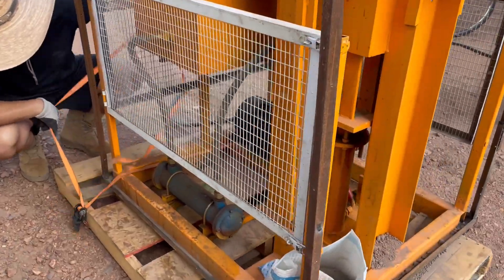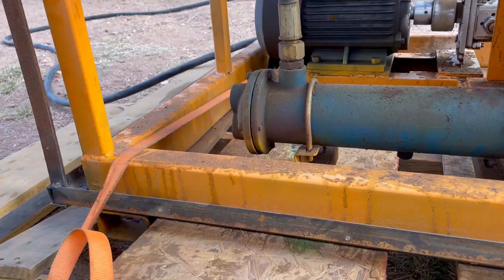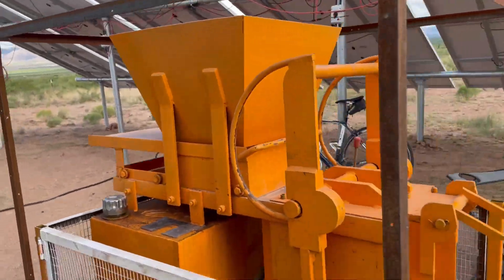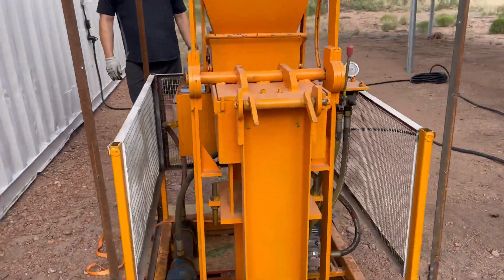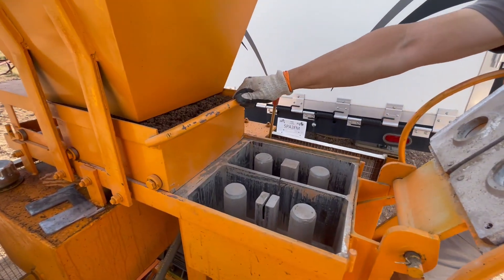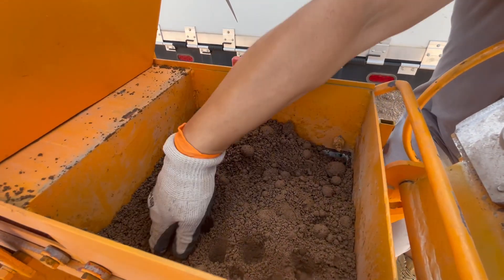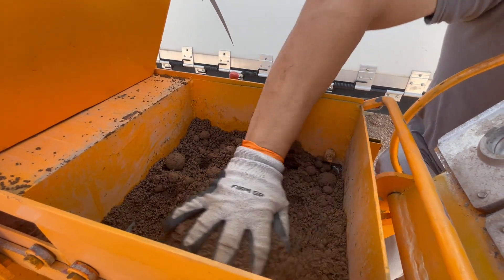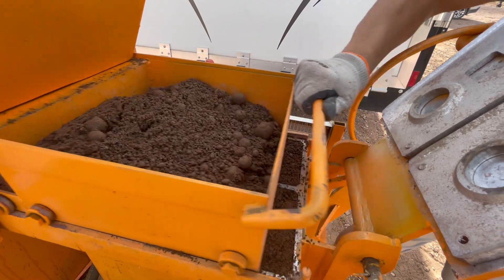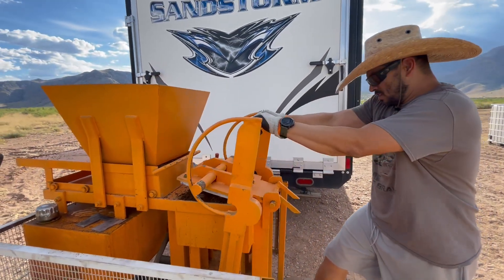But we chose to take a different path. We imported a machine and we plan to do compressed earth brick, or interlocking compressed earth brick — I've heard it said both ways. The good parts about it are that once you're done, you stack the bricks and build your house. You can dry stack it or wet stack it, meaning use mortar or not. Once you're done, you don't have to resurface the wall, paint the wall, or cover it with cob like a lot of super adobe or earth brick houses have to. With earth brick, you're done once you stack the bricks.